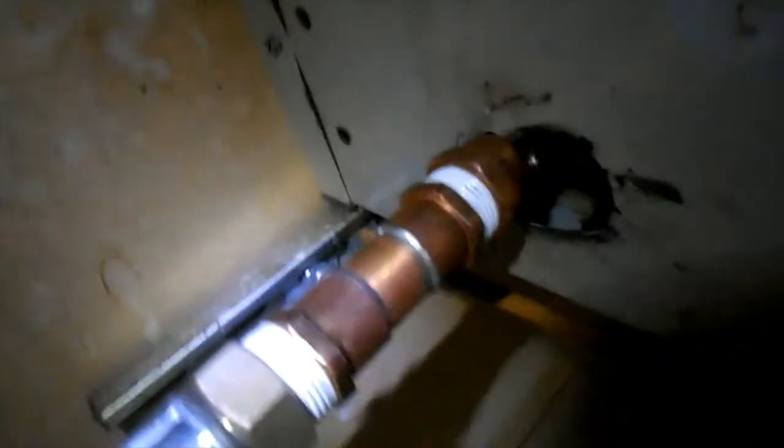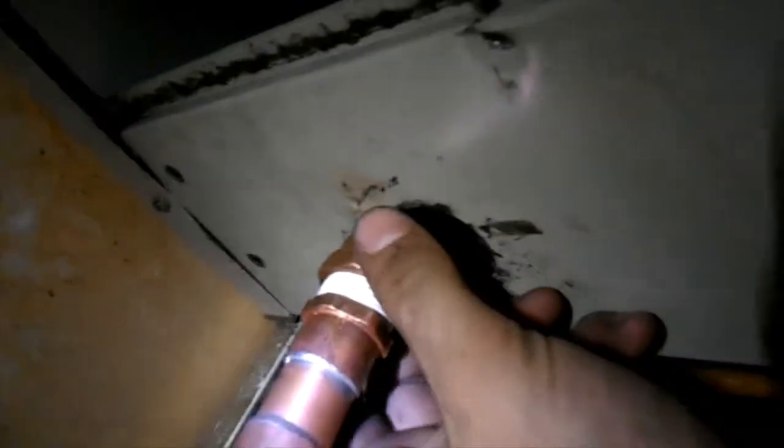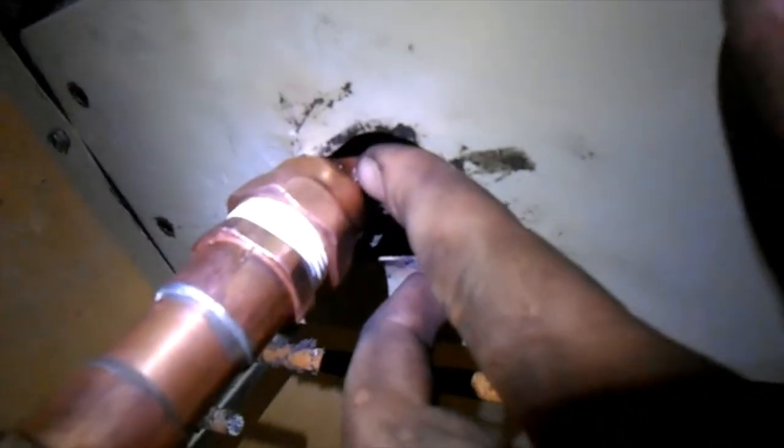I got here and found the condenser water valve off, which was a good thing, because we had the old hose sets with steel ends on them. We had something like this over here — this is the new piece obviously. The factory female fitting here is five-eighths inside, five-eighths refrigeration, and then goes to three-quarter pipe thread out here, so it's a little special adapter.